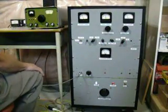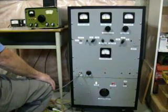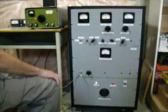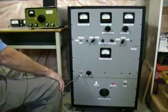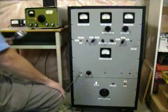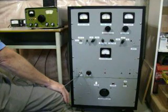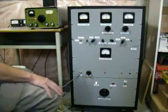I'm running about 200 watts here with a carrier, Wayne, so let me turn the power down and let me know if the audio changes quality. I don't think it will, but just curious. It's about 100 watts now — don't want to go any lower than that. The SWR is flat, nothing — I can't even see the needle move there, Wayne.